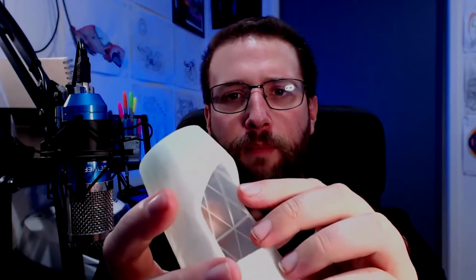A couple things that didn't turn out so well is this little bit here on the nose. I'm not sure what happened there. There was a bit of a weird defect in the original as well. I think I've got this cutout for the hatch with a little tab that goes in there. I've got that too high up to the surface and it's causing a little bit of a print error. It's maybe too thin of a wall for it to print properly, less than 0.5 mil, so I might reprint it just so that I have a nice piece there.